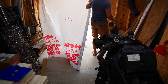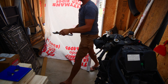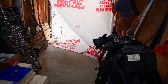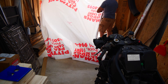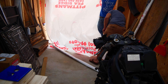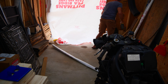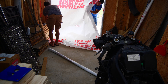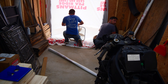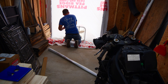To get started, we needed to clean up the lean-to a bit and get a fan installed for a negative pressure environment to pull the overspray out of the booth and keep the air just a tiny bit cleaner for us. We started off by putting a box fan in and enclosed it with some excess house wrap that was laying around the lean-to. The box fan was just far too weak to be usable, so we went and grabbed a better vortex fan — it just couldn't pull enough air through without it.